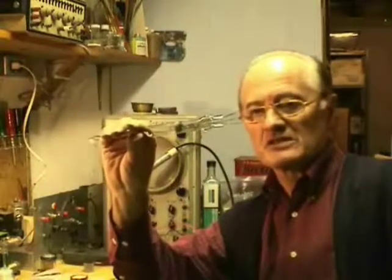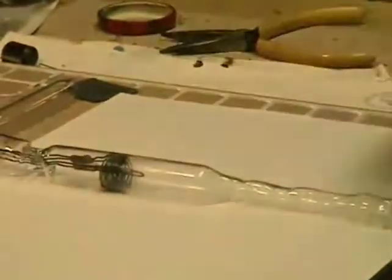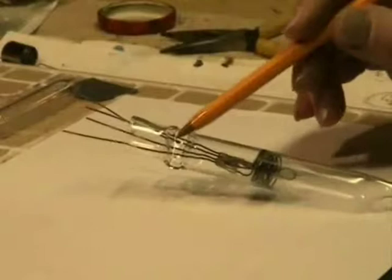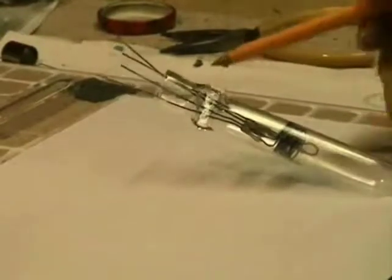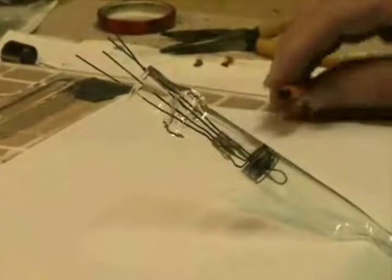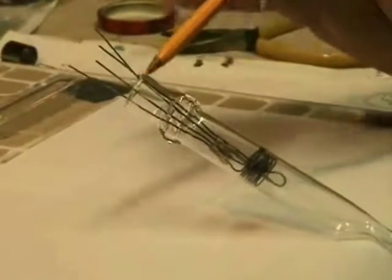I will have to do a very good job of annealing otherwise I will crack something when it finally cools down. It appears to be working — I've done a complete press across the whole width of the test tube. Here's a close-up of the press: down here is the evacuation tube pulled from the top of the test tube, in the middle is my set of tube elements, and here is where I have pressed the glass across the four leads. Because of my past experience trying to seal iron wire into Pyrex, even though I copper-plated the wires, I put crazy glue in here and let it settle down along the wires, then I'll pack vacuum grease in and seal with epoxy.